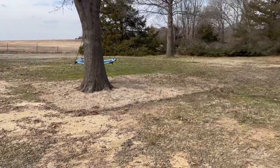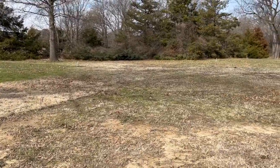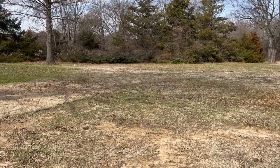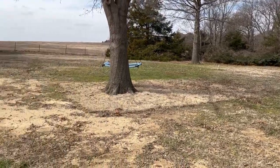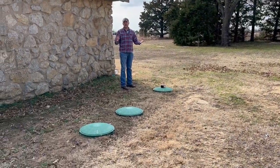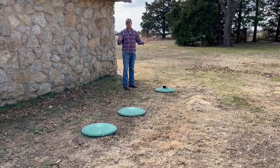When the timer reaches the point where it's set to spray, and as long as that bottom float is engaged, it'll spray the gray water out into the yard. I have my two sprinklers marked with PVC pipe so I know where they're at and don't run over them with the mower. It is really that simple with an aerobic system — I hope this video helps you better understand your system and how it functions.